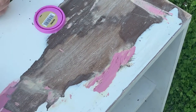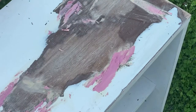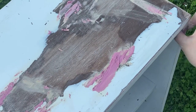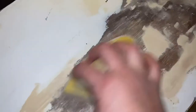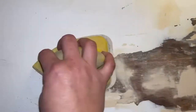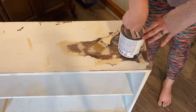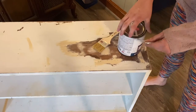I filled in all of my gashes, and what's really cool about this wood filler is when it dries it turns the natural wood color. Once dry, I lightly sanded it — about 120 grit then up to 220 to give it a nice polished finish. It's so easy and you can't even tell there was a fail. Moving on to yet another day.